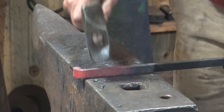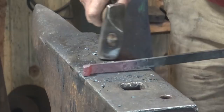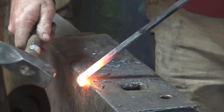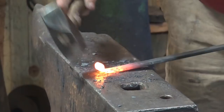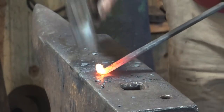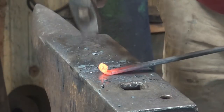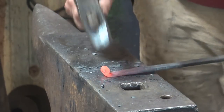That tapers out nicely so we'll chamfer the edges off. Next it's going to be just a little bit more refining — this doesn't quite look as round as I would like it to. Now I'm going to stand it up on edge and work that part I left a little pointy to get this to tuck down nicely and form a nice scrolled end. If we had rounded that to start with, it would be oval now instead of rounding up. So we left a mass where we wanted it so that it finished the way we wanted.